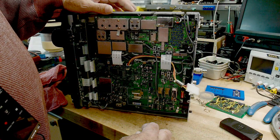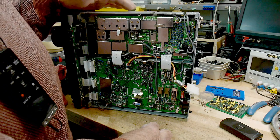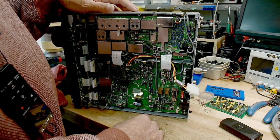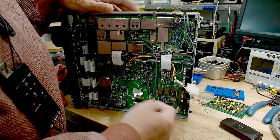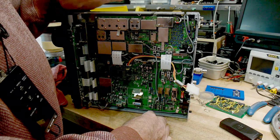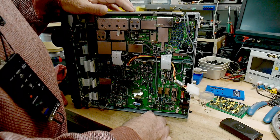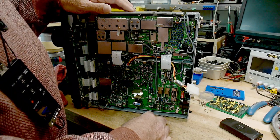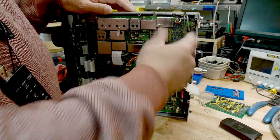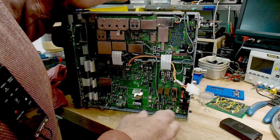It is known to go bad. Some people put a heat sink on it afterwards — I might glue a heat sink onto it. Some people solder one to the pads because the heat comes out the legs. Maybe just a little heat sink on top will make it happier. They're no longer made and are hard to get in the U.S., so I had to get one from Asia.